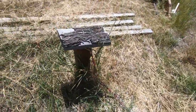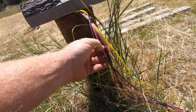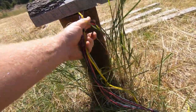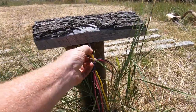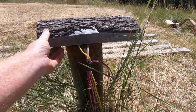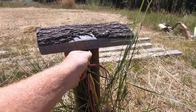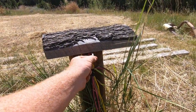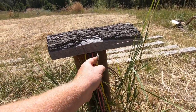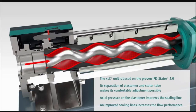If you notice here, I've got five wires going to the pump. Three of those are power wires, and the other two are small sensor wires — basically speaker wire is all I had — going to the low water alarm sensor that shuts the pump down on low water, because you don't want to run this pump dry.